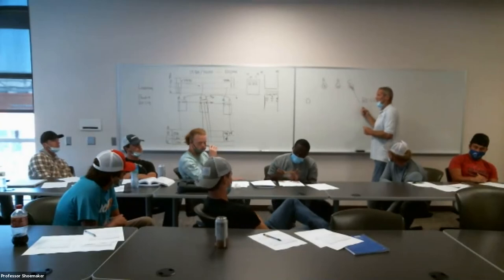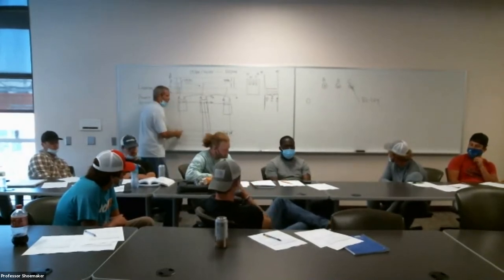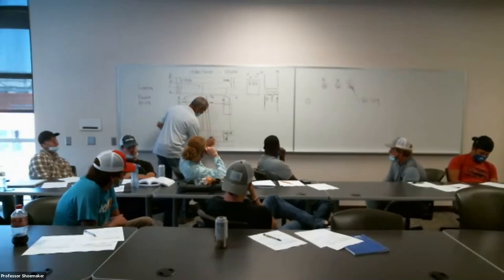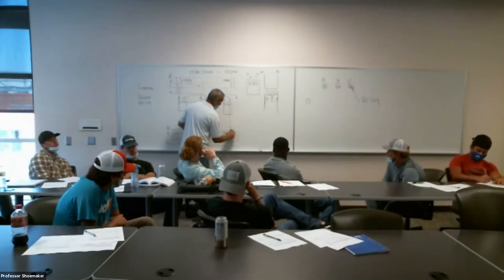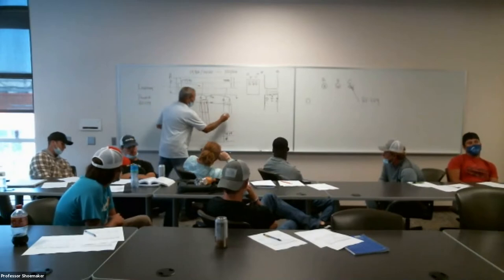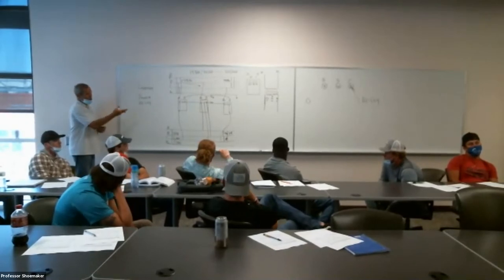Yeah. Okay. But that does not jive with my drawing. That's where I get kind of complicated. It's a company-supplied schematic drawing. Where do they have the high leg? A. So let's fix it. Let's get rid of some secondary. So I move this to A, B. Where's my high leg? Where does it need to go? That's the way you did it yesterday, correct? Correct. Now I've satisfied what the customer needs, what I need, and the customer needs on their side.